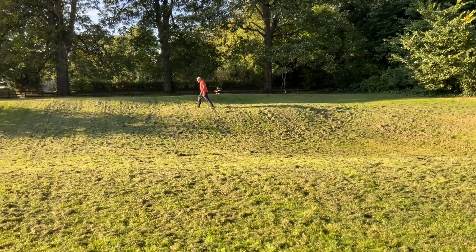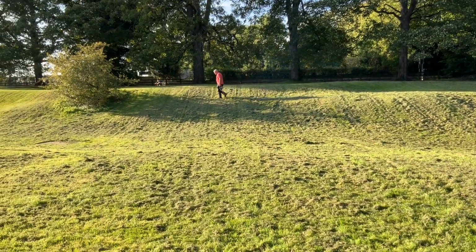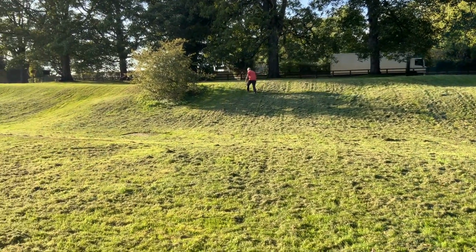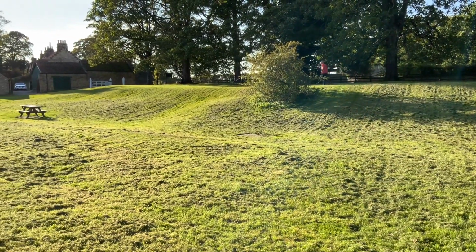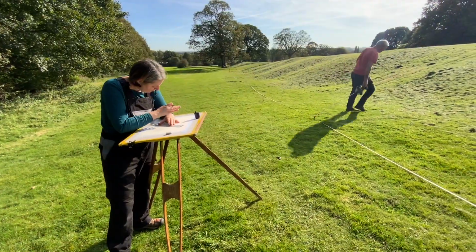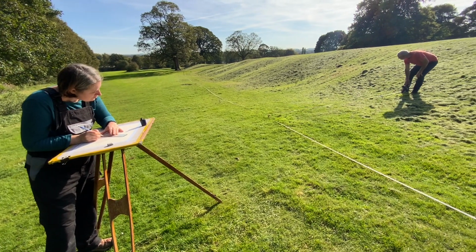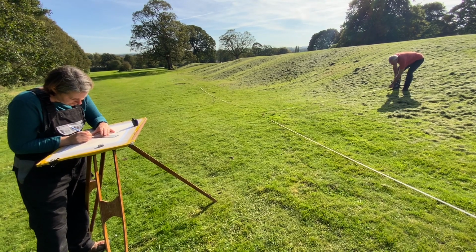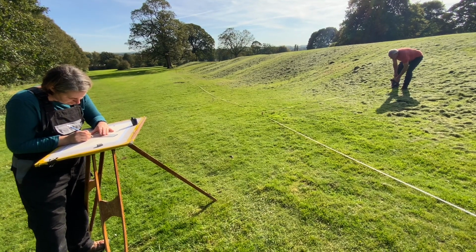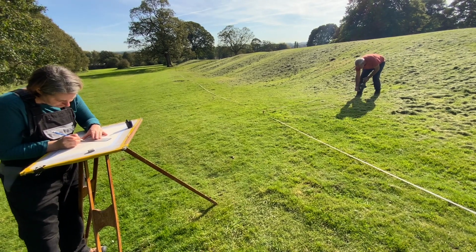Changes of gradient are easy enough to judge with a crisp slope, like the sides of this Roman defensive ditch. But what about when the earthwork is slight and variable, and maybe meandering around a little? In those circumstances, looking down at your toes can be misleading. The person doing the taping should look to either side of themselves to get the general trend of the changing gradient, and then try to be consistent in picking the same line on all the subsequent measurements.